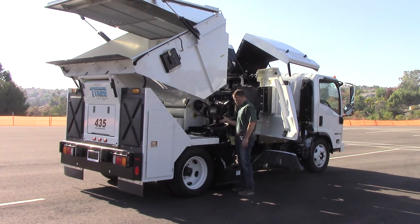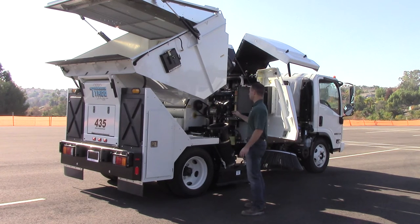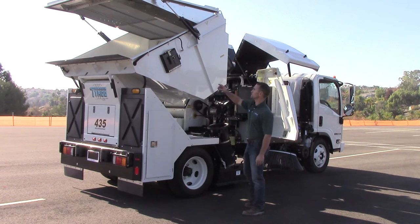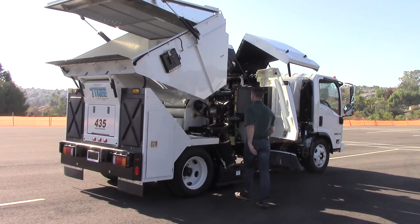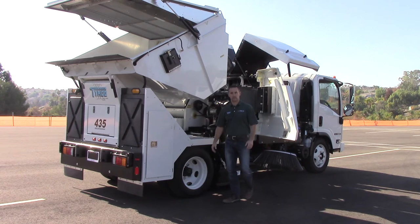This little plug right here is just how we clean our dust separator. On our regenerative air sweepers, we have essentially one moving part. If you're not using gutter brooms, the only moving part of the whole sweeper is the blower wheel. We just need to allow this sweeper to breathe — it breathes through the screen and through the dust separator. At the end of the day, when the hopper is full, you dump the hopper, make sure the screen is clean, make sure the dust separator is clean — which is why we have this plug. We just shoot some water in there, let it run off. Those two things are clean, and you're going to sweep like a mad dog.